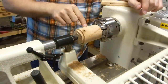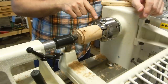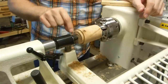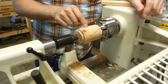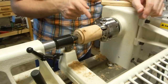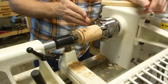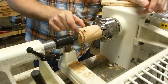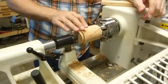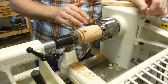What we've done now is turn this piece around in the chuck. This is the reason why we had the tenon cut on the other side — now the side that is drilled and tapped is in the chuck, and this is the end side. We've got to work on this side, because when we screw this onto our live center, whatever we're going to press up against our workpiece is going to be out here. I've drawn a line to mark how deep the drilling is — it's only a 3/4" hole inside, so we can shape a lot of this off. I'm going to part it off right about here, then shape it down, sand it, and finish it. Even though it's just a utility piece, I still want it to look nice.